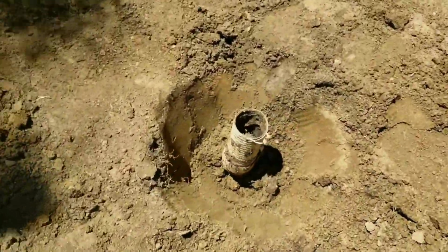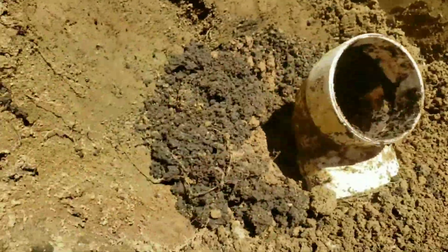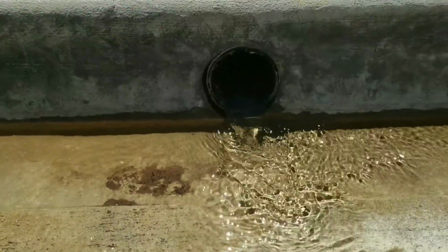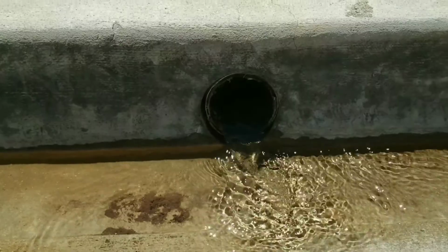We found the drain, we made sure that we opened them up and took out all the mud that was inside. We go ahead and take out both ends. We take out the big stuff with the end, and then we go ahead and take out the 90 coupling that it goes. And plumbing for irrigation is just the same as plumbing for sewer right here. It's all the same thing. Everything glues the same. It's just at 3 or 4 inches instead of 3/4 or 1 inch. You can see everything's in the clear. So let's get into rototilling.